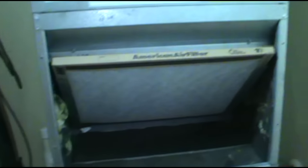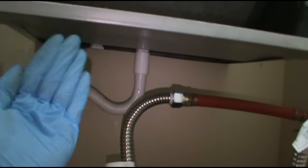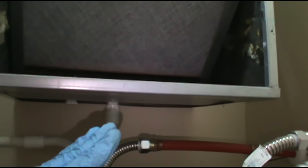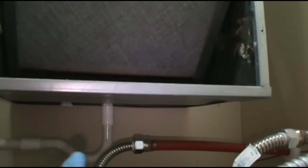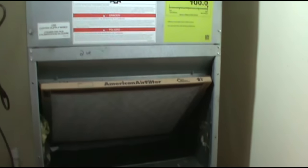Alright, I'm going to button it back up and test it out, and go get a new filter too. I'll put an old drain tab in here to keep it clean. Alright dudes, it's buttoned up - it's cooling, it's back up and running. You can see the float switch didn't inhibit the filter in any way - that was my only concern, so we're good there. Second best idea I had, you know, about having to take the whole thing out and redo it and level it. We've done the whole wood behind there trying to bring it out and level it - it helps a little bit. It's so weird man - the pan will be slap empty, so it's draining. We know it's draining because there's nothing in the pan, and the float switch will be full and the unit will be off. So that's what I went with - the old clip-on float switch. I think it'll do. Thank y'all for watching the Dirty Maintenance Show.